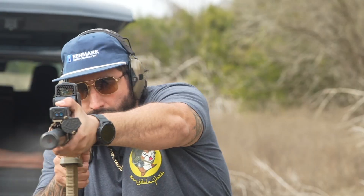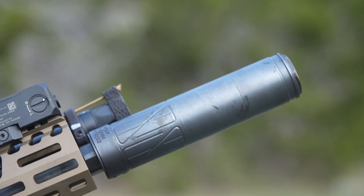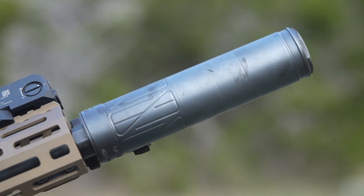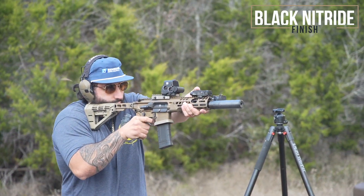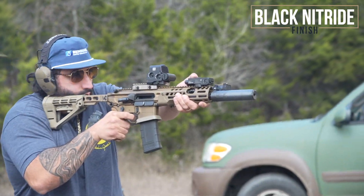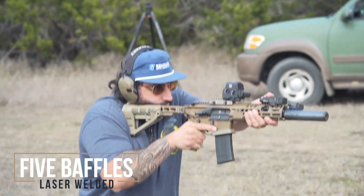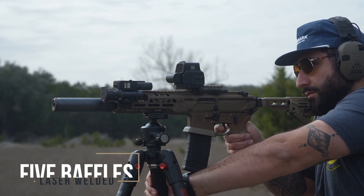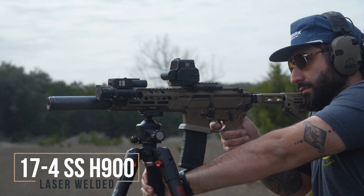It is built to optimize suppression and back pressure on both supersonic and subsonic rounds, as we tested today on the Sig Spear 300 Blackout. Like all of our other centerfire suppressors, it features the same Bravo hub-compatible mount in the back. The core and all parts of the Peak 30 are black nitride finish — the nitride process chemically changes the outer layer of the steel, greatly increasing hardness while keeping the core tough. The core of the Peak 30 is a five-baffle design, laser welded from 17-4 stainless steel, heat-treated to H900 condition. The baffles feature a tapered leading edge and porting that optimizes back pressure and suppression for both supersonic and subsonic rounds.